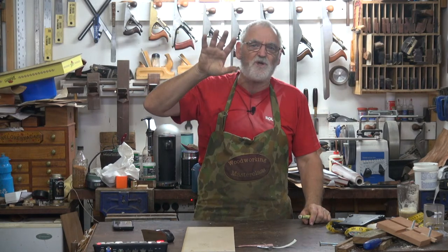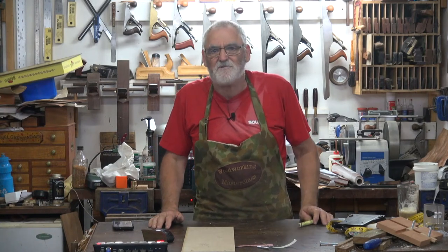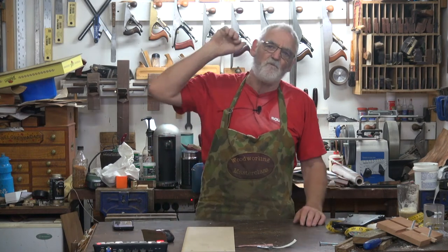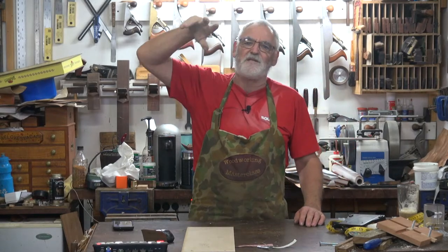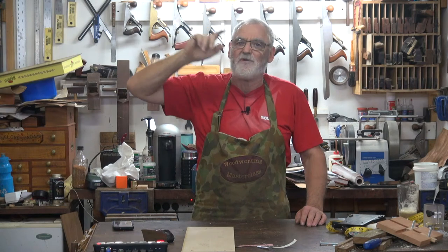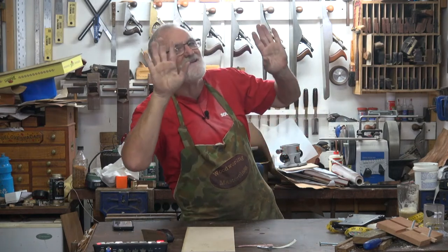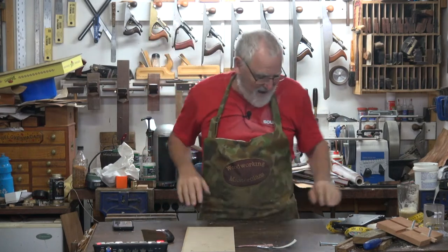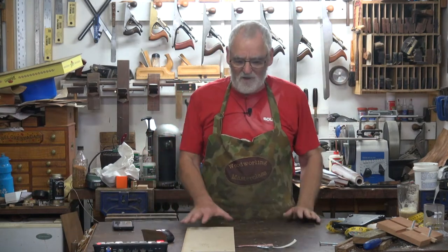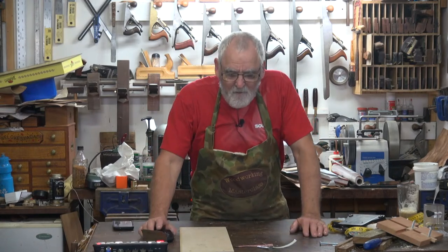It's too heavy. I wouldn't have put it on a plasterboard wall on the inside, even with Ramset toggle screws. So I actually wall plugged it, put big 3-inch 10 gauge screws in it, which were hanging out about 3/8 of an inch or 10 mil, and then I had brass chain on the back. And getting underneath it without touching the frame. Anyway, I haven't got that bit on video, but I've got it, put it together and hang it up on the wall, and I'm in the process of editing that. So by the end of the week, it should be up, which will be good.